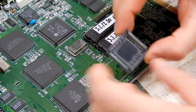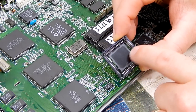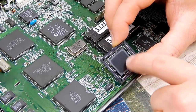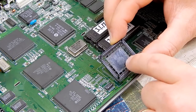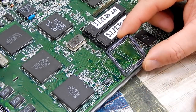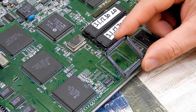But for where my soldering game is at, what I'm going to do is remove that bit of plastic in the bottom. Yes, that will weaken the thing, but it'll make my job of soldering an awful lot easier. Plus, it will make it a lot easier to tidy up afterwards. I'm going to have to use flux in here, and trying to tidy up flux around this plastic, well, I just don't think with cotton buds and IPA I'd be able to do a very good job, so that has to go. So that is that removed, and you can see now that the socket is a bit more flexible, although hopefully when we get it soldered in place it will regain some of that strength.